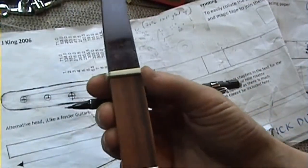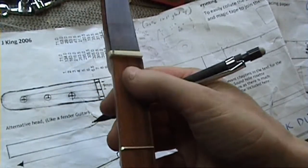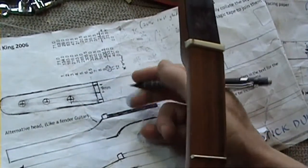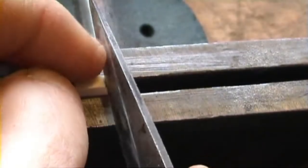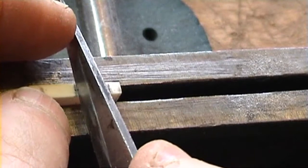I've done this at just under 25 millimetres wide, just under an inch wide. I'm just going to slightly reduce the size from nine millimetres probably to around about eight, maybe 8.1 but just fractionally over eight. That's all within playability. It's a small scratch line on each side and the centre line.